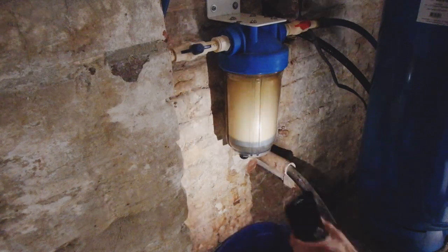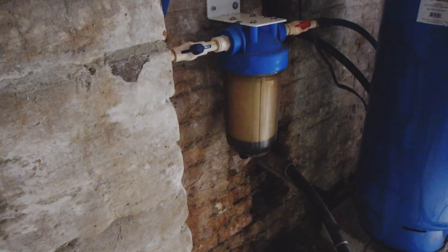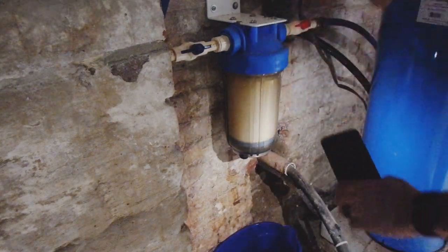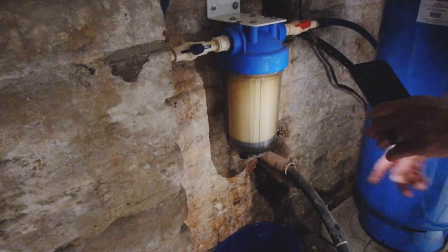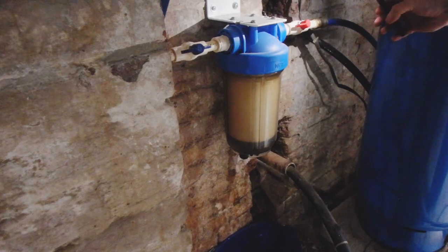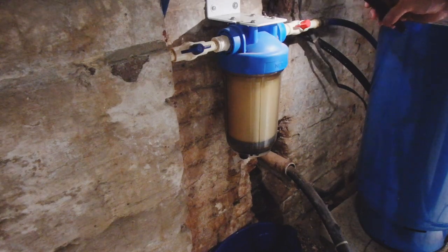No dripping, no leaks. But this is why I always keep a bucket of water in here. Take this bucket, empty it out, and put it right back. Come check on it the next day — the bottom of that bucket should be bone dry by tomorrow. That, my friends, is how you change out your whole house water filter cartridge. You saw I did not tighten that back down with a wrench — not needed. I'll put a link in the description for that food-grade silicone grease so you can check it out if needed.